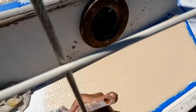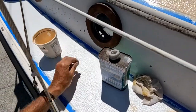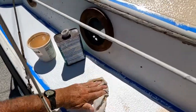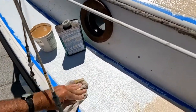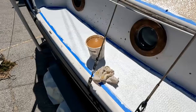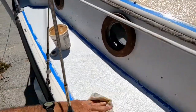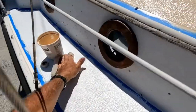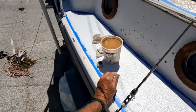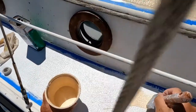The roller will vary in thickness as to how much paint is actually going down. I noticed when I was doing the deep cleaning that some of the old paint would tend to come off with the sprayer — and I wasn't using a pressure sprayer at all, just a garden sprayer like you'd use at home, so it wasn't excessive pressure. I don't think it's a great idea to use a high-pressure hose on a fiberglass boat. There was quite a variance in thickness of the previous paint, so I think brushing will give me better coverage.